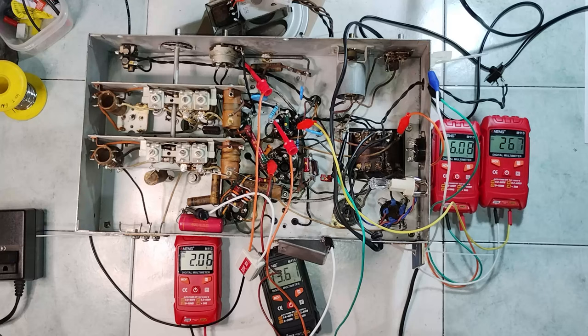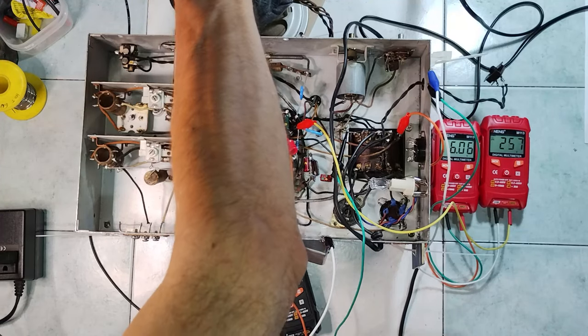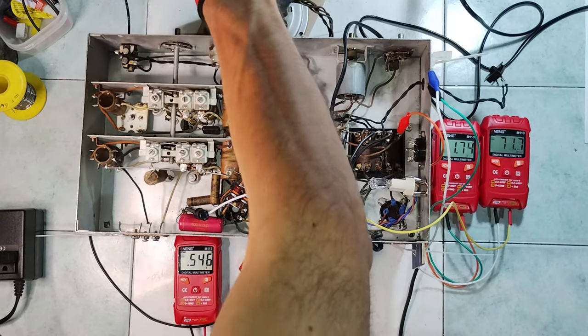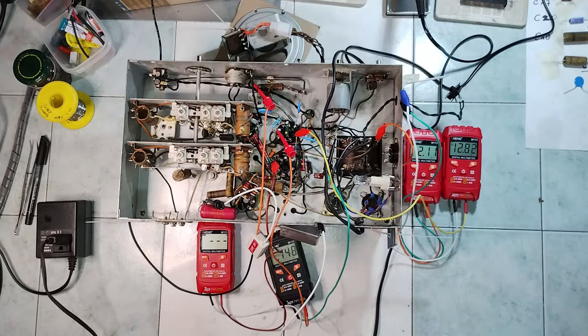All this might suggest that the radio suffered from internal oscillations in the audio preamplifier section. And in fact, an early test done when only the audio section was restored without using the extra shield for the tube type 6Q7 showed the possibility to start oscillations. This issue will be solved keeping the old modifications and changing the value of one capacitor, but the details will be shown later in the section about the schematics.